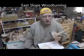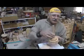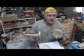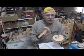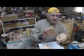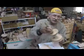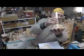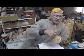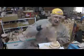For a couple of years I've been making these yarn caddies, or yarn butlers, called by a lot of different names. I make mine all out of wood. There's a base, has a post in it. The hole in the spindle is slightly larger than the post. The depth is critical so that it doesn't touch, just clear of the base, and they spin beautifully, very little noise, well balanced.